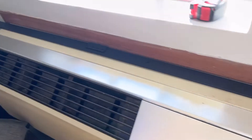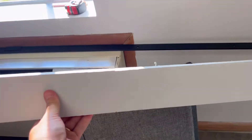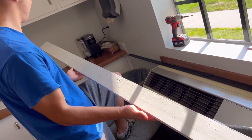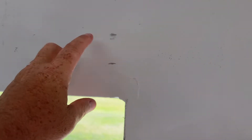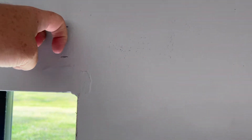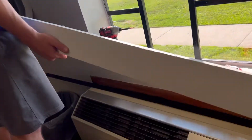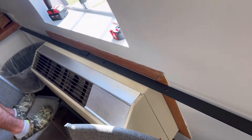Here's our barn rail. It has pre-drilled holes, but in a perfect world those holes would match up with your studs — and we don't live in a perfect world. So this is where we put our header board in, which is just a 1x4. We've got spots marked on the wall, and the rail is going to sit in the middle of that board, set at the right level so that once the whole wheel assembly hangs down, the door comes in just below. Then we mount the barn door rail to that header board.